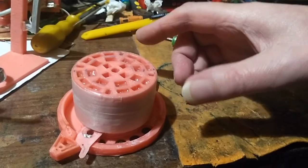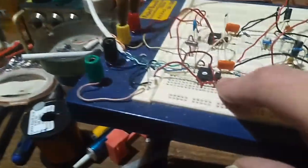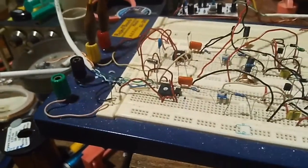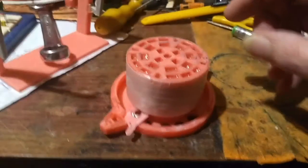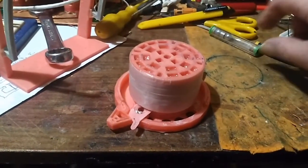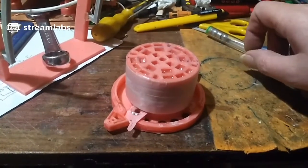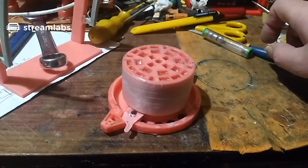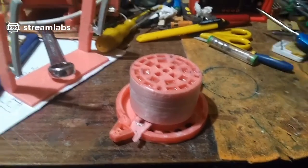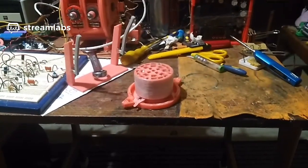The trigger coils don't need to be massive because they're only driving the opto isolators on my breadboard — which is basically just an LED. Because I've got 90 ohms on the coil and there's a lot of turns on there, I should get enough current to drive the opto isolators. It shouldn't require much current at all. Anyway, that's it for now.